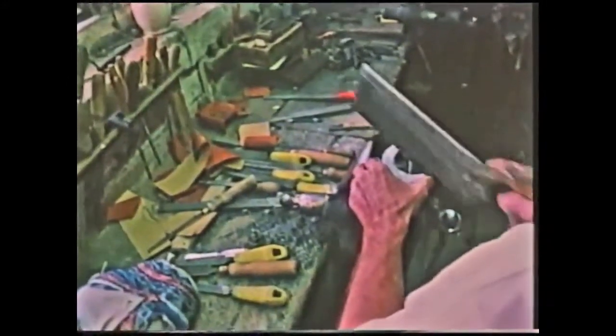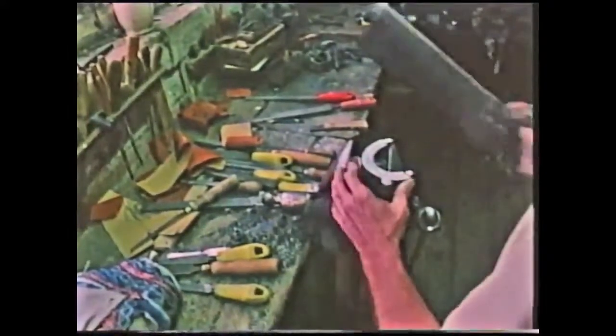The roughly cut out shape is offered up to the pot and the positioning of the sockets marked. The pegs to go in the sockets are formed by making cuts with a tenon saw and then using a knife to cut off the surface layers of the fiberboard. During this work, the handle is held in cutter's clamps, made of wood, and dipped in water and whiting, which prevent damage to the handle. The handles are then marked to get the exact fitting to the sockets.